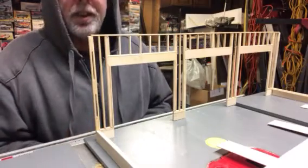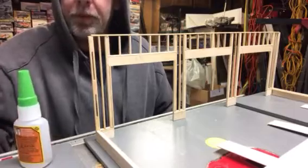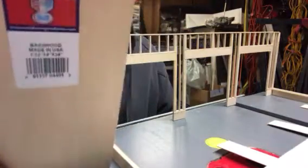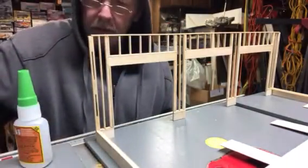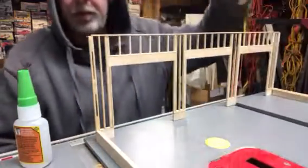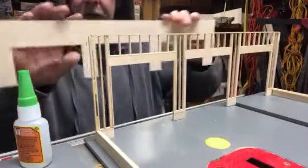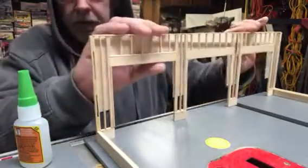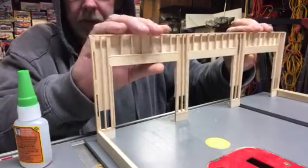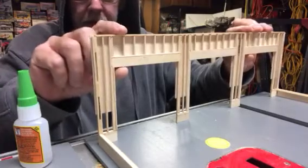With that being said, I'm actually going to go over it real quick. For the sheathing, we're going to be needing our plywood. That's what we're going to be using tonight. I've already got one piece cut out - all I did was take a sheet of it and cut it 16 and a half inches long. You stick it up there like so, get everything flush with the outside edge and the top edge of the 2x4 up here. Get it all flush.